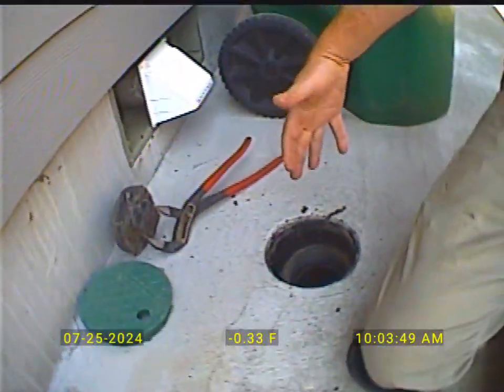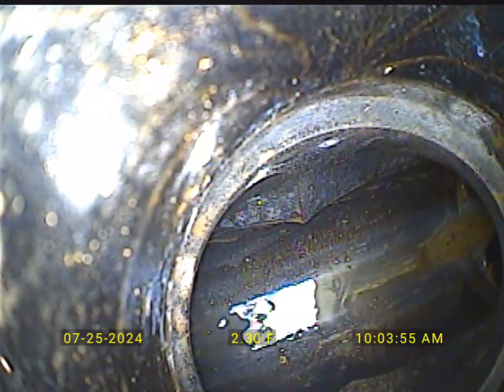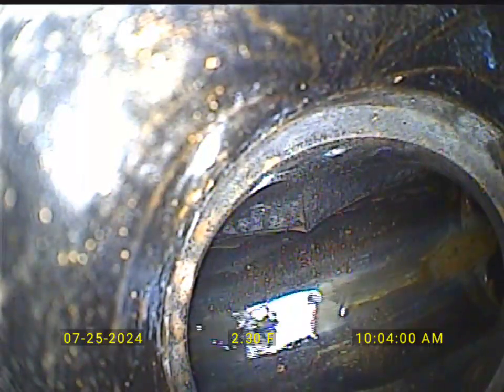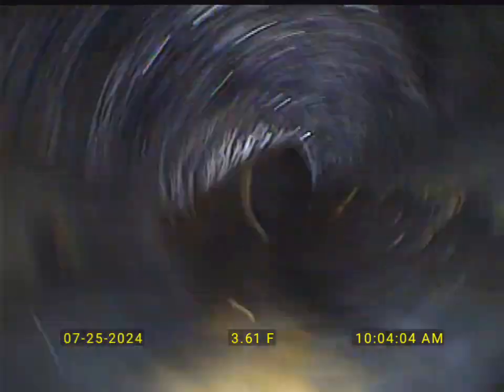Luke Oregon Home Inspections, 3622 Stark Street — doing a sewer scope inspection. There's a clean-out on the ground right here, I'll use that. So we've got some 4-inch ABS piping, which is the same or similar to new construction, so that's good. We're making a little 45 here, little 90, and we're going to go along the house and up under the side gate.